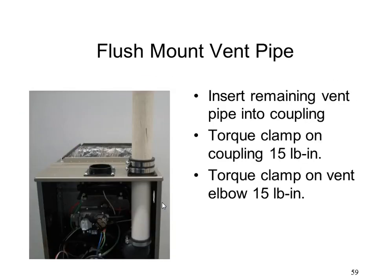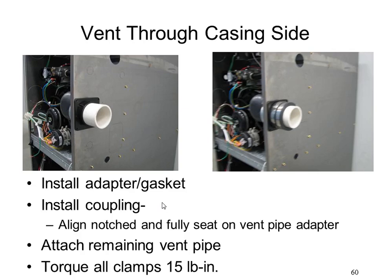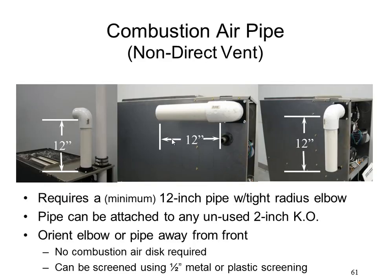You can run one piece of PVC all the way from the inducer motor through the top of the house, or use the recommended two-piece approach splitting at the coupling. The same adapter plates are used on the left or right sides for both combustion and exhaust air, helping with gasketing to seal the unit and providing weight support on the side of the sheet metal cabinet. The exhaust venting must go all the way out of the unit; combustion air preferably comes from outdoors, but if stealing from the room make sure you have one 90-degree elbow and a foot of pipe.